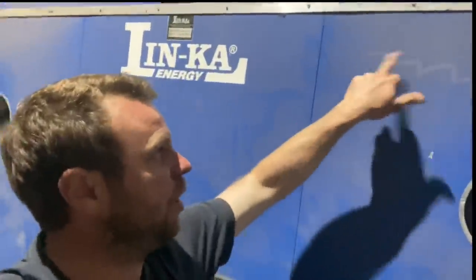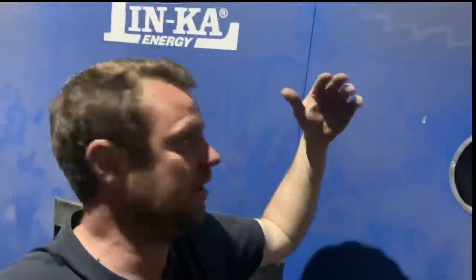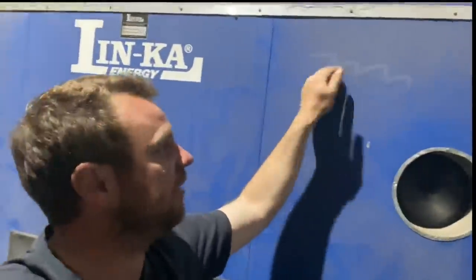Well, that basically burns on top of this, all the wood. It superheats it into gas, burns the gas, which then produces the heat. It's that efficient, it burns the wood as a gas, not as wood. Anyway, then it goes on these things that are like them slots that they have in the arcades, and the ash walks to the front, which is here, where this door is, and then falls off a cliff, if you will, about an 18-inch drop, into what's called an ash auger.